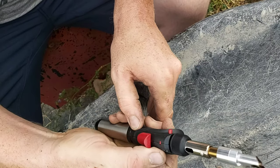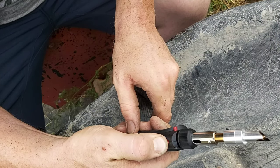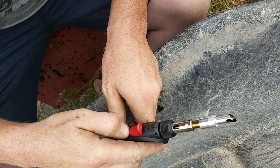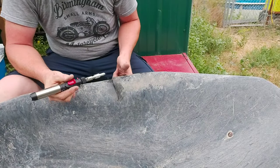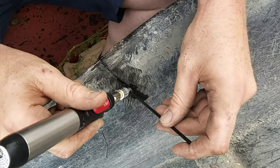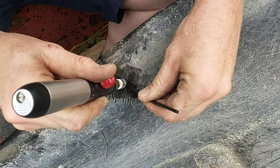As you saw a second ago you're just gonna have to clean off all the dirt and debris off the top of the plastic before you weld it together. I'm sure this isn't essential to the welding but if you want a good weld it's probably a good idea to do that. Not shown on camera, on the first one I did drag the tip a little bit down it to create a bit of a V pattern, and I did do a little spot weld to hold it together on the other side.